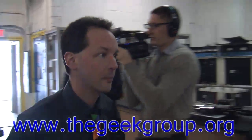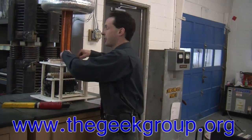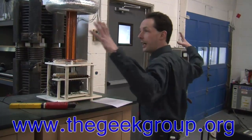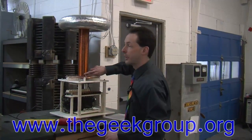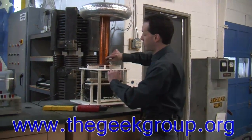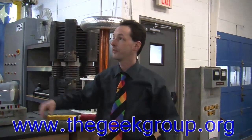Now take that to the next step, and you have this — we'll do it here with a little Tesla coil. This power supply charges these capacitors. When the capacitors reach full charge, a spark jumps across this gap and dumps that charge from the capacitors into this primary coil. That big dump of energy from a capacitor into a coil creates a big magnetic field. When it collapses, all that energy gets magnetically coupled using inductance into the secondary, and that charge shoots up the secondary — pumping like 15,000 volts into the bottom. That rockets up to the top and then comes back down. This is our heavy bag — we've just pushed it. It goes up, it comes back down, and right when it's up, this fires again. It's timed so that 15,000 volts builds and builds and builds, and pretty soon you flip the bag up to the ceiling or throw the arc out the top. That's how a Tesla coil works.